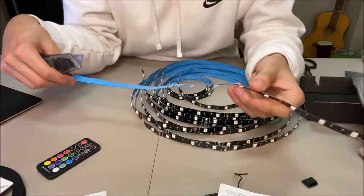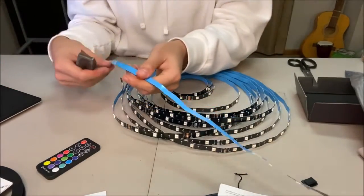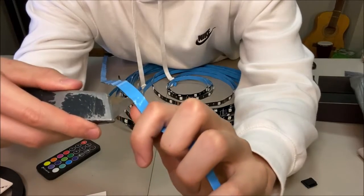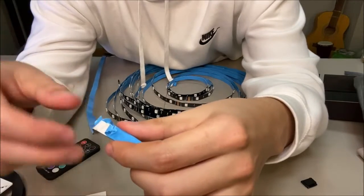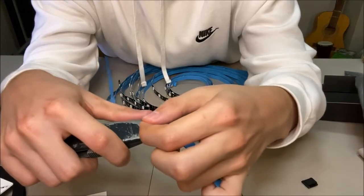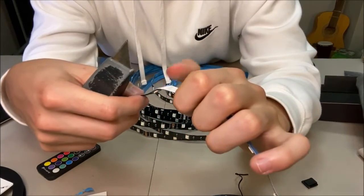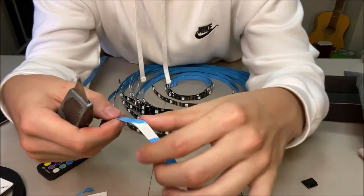What me and my dad decided is that every foot you make a cut. So I'm going to go over to the last sticky piece — every foot. You very slowly put your knife underneath the blue and pull it up, then cut through it so you can see a little piece of the white. You grab your knife and pull towards you — you've now created a little slit. You do that every foot, and when you put it on the wall instead of taking a big strip of paint off, you might just take off a little bit.